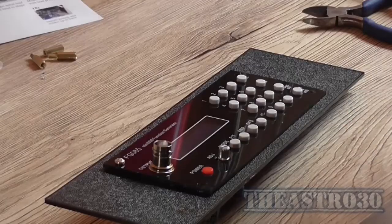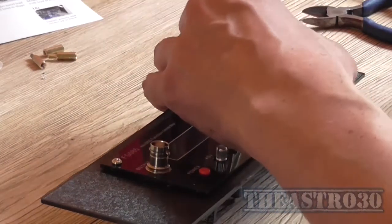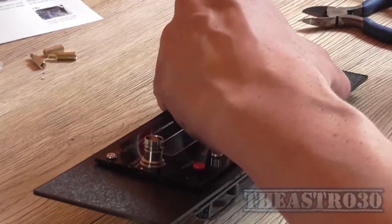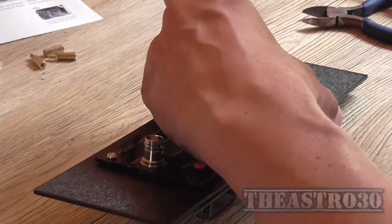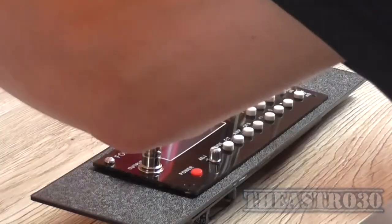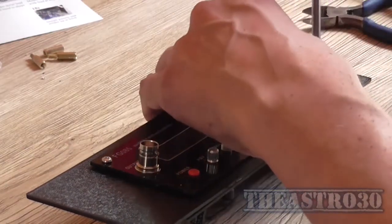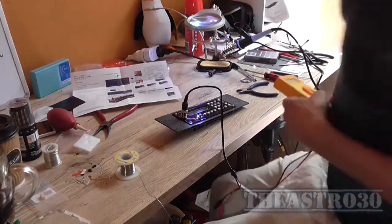So that does actually give me the clearance I need, because this panel is about 2mm thick. Yeah, and this front one's probably about 1.5mm, so that adds an extra 4 odd millimeters to the distance away. So by changing the 15mm spacers to 10mm spacers, I cut that extra 4mm off. It's getting hot in here, so take off all your clothes.